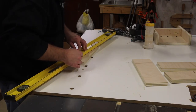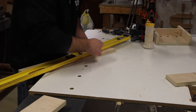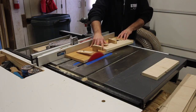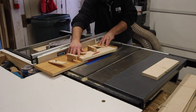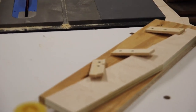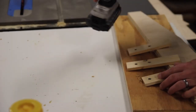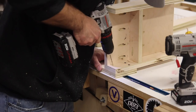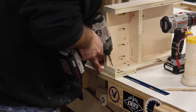Before I attach the legs, I have to taper them. I knew back when I made the activity table that I was going to be tapering the legs, so I made a tapering jig out of scrap wood in the shop. There's a free downloadable plan for the tapering jig over on the website. One of the supports holding the workpiece down is cracked, so I have to replace that piece — but that's the beauty of it: if something breaks, you just make another one. I use the tapering jig to taper all the legs.